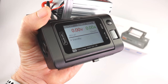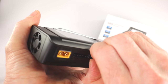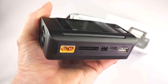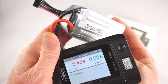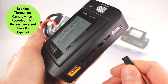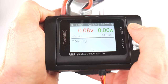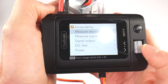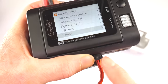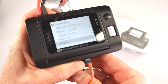Since this is just a quick overview, there's one last function — you pull this piece of plastic out. Most people won't use this unless they're in the RC hobby. It's a port to test your servos and check resistance for items used in the hobby like receivers. You plug anything in the front — minus on one side, positive on the other. To get to the test menu, hold the button down. You can measure resistance, signal output, do an ESC test, and check power. Most people in the RC hobby will use it for airplane servos.